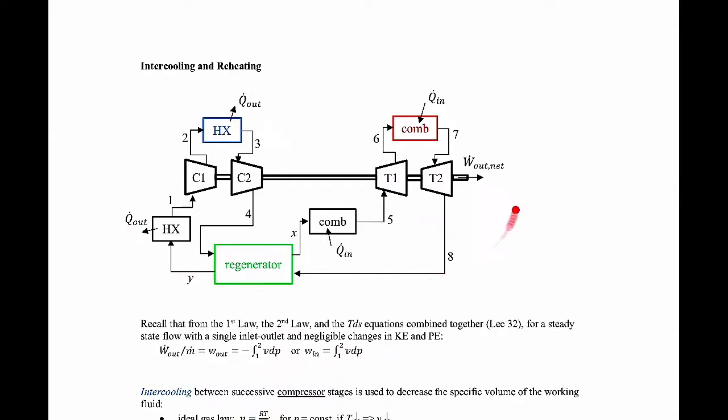They'll all refer back to this picture. This is a complicated picture of a Brayton cycle with these various improvements. On this side we have two compressors — actually two stages of a compressor. Think of this as the compressor, and then over here we have the turbine. We have a shaft that connects everything so we can get some power out. You've seen this sort of thing before for the Brayton cycle — a compressor and turbines on the same shaft. It's just now we've broken it up into two compressors and two turbine stages.